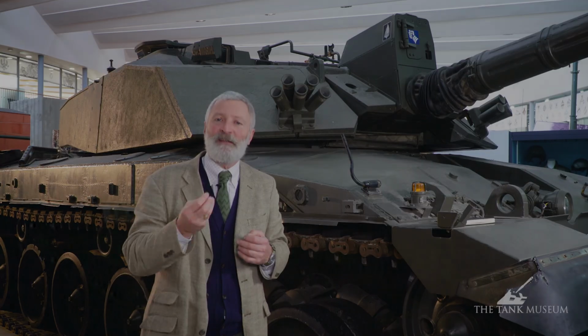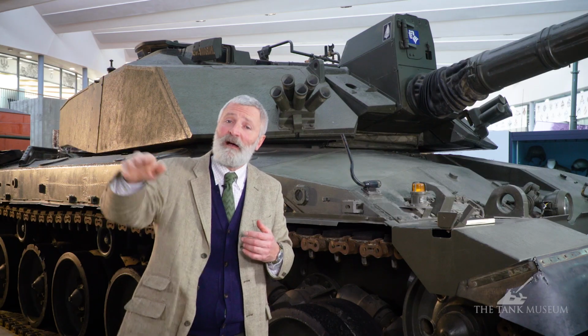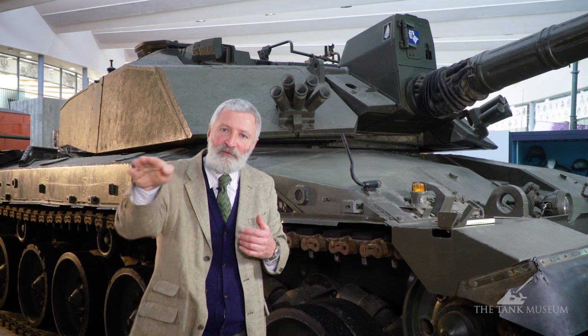It's got a laser range finding system on it that is accurate plus or minus 5 meters out to 9,950 meters. And again, back to looking at generations of tank, this idea that you can accurately estimate your target is really important. So that again, if you're firing HESH, if it's going over the top, you know exactly where it's going to land. If you're firing directly, it's in range, because again, flat trajectory of a fin round that's going off direct towards the target. These are all elements that come into play.